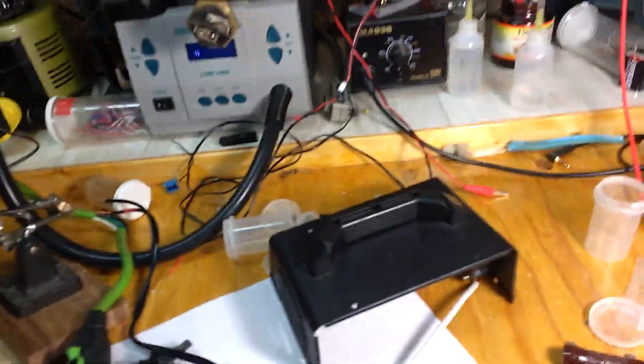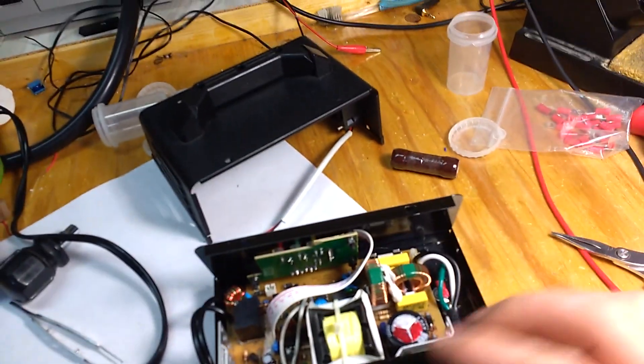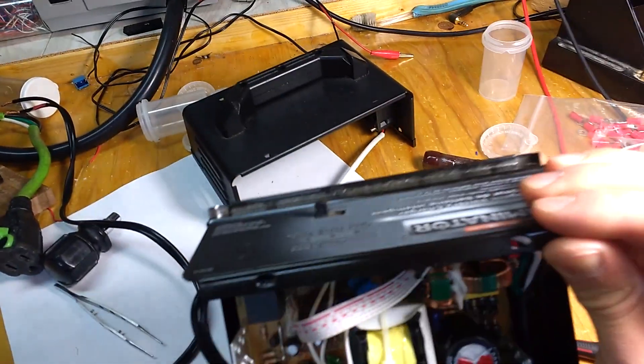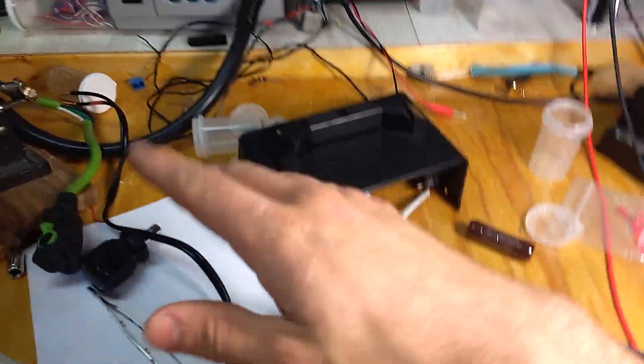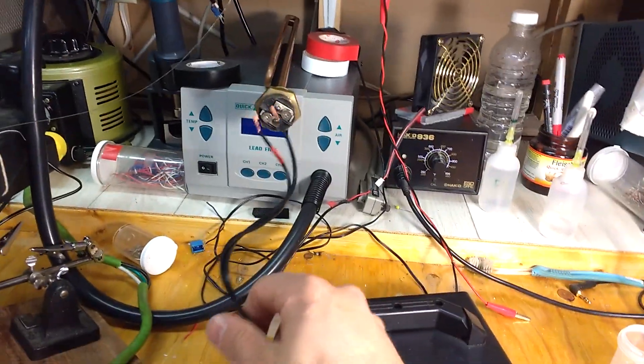One quick contact just to get 12 volts in here — that'll turn on the output relay, and then once it's on the green LED will turn on. In standby you can have nothing connected on the output, that's just fine, and then you can swing this on your external load and test it.